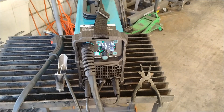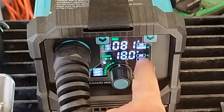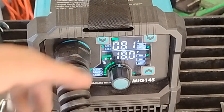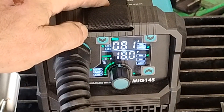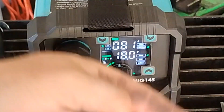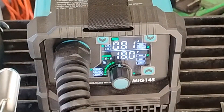A subscriber specifically requested this week's Fluxcore Friday be done with the BestArc MIG-145. I've got it set to gasless MIG .030 wire on 2T mode. I did some testing on scrap pieces of the same material — despite what the chart inside the lid said (16 volts, 50 inches per minute), that wasn't getting it. After testing I've settled on 18 volts and 81 inches per minute, and I am plugged into 110 volts.